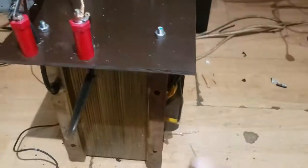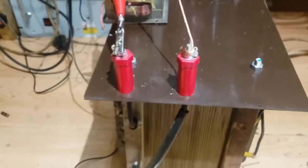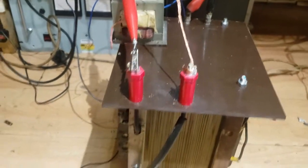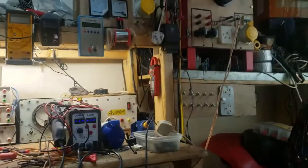The transformer is all put back together now. I've put a phenolic top on here with standoffs and feedthroughs for the high voltage cables — these are proper silicone high voltage leads. When running the Tesla coil, one side of the secondary will be grounded because it goes to the cathode and the voltage doubler. For the feedthroughs I've used some piping to keep the HV lead clear. The inside winding closest to the primary and core is grounded, but you could run it floating or ground either end — there's plenty of clearance. I've got a divider probe and the full setup connected to my variac for a demonstration.